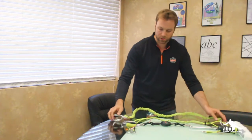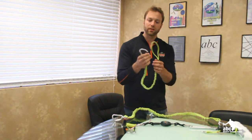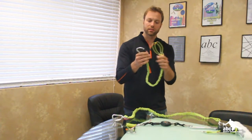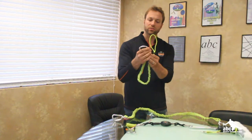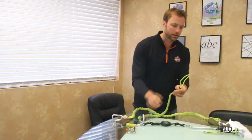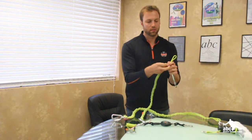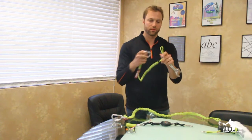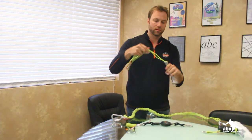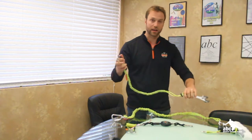The second one I'm going to show you is our 3108 lanyard. This is a double action lanyard. You'll notice that all our carabiners are moving to captive eye carabiners. This is a 10-pound rated unit, double action — twist, pull back — and then the loop end you can choke around a tool like so. Slide through the end of a captive tool, thread it through and cinch it down. Now you've got a tether and you can connect this end to your harness belt or static anchor point.